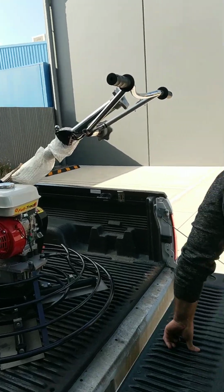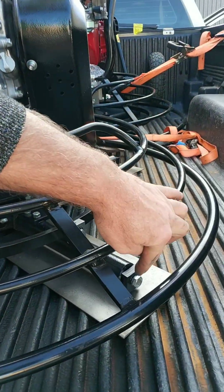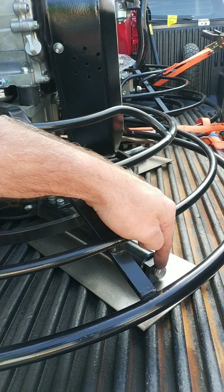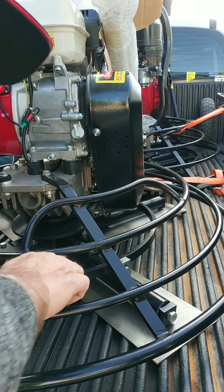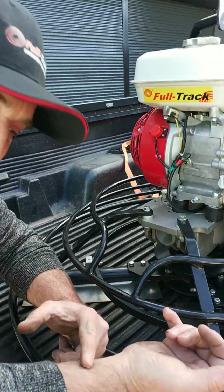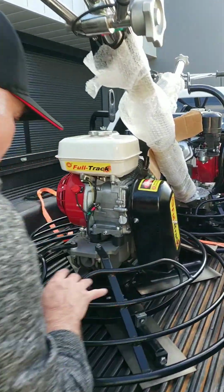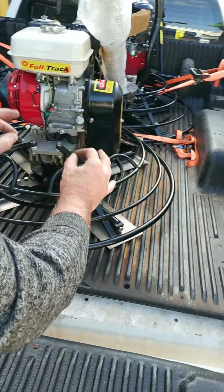As you can see on the machine here, for changing the blades, you only need to loosen one bolt. And slide out and slide in. One bolt. You can do it within 10 seconds. And you don't need to go inside. You're not going to harm your knuckles. You go on the side, you're not going to cut your wrists. It's safe. The other thing is, all my four blades, they move together. One blade cannot move independently.